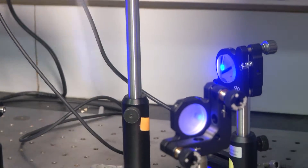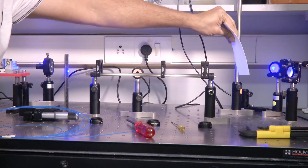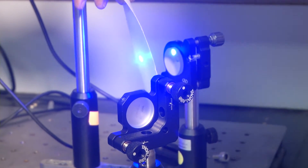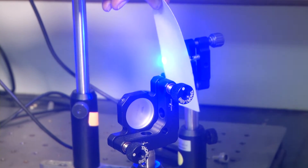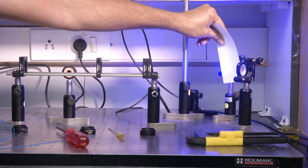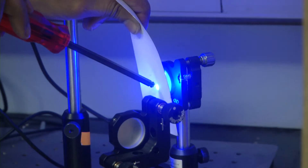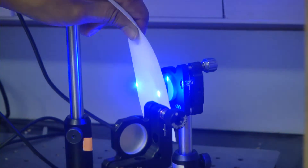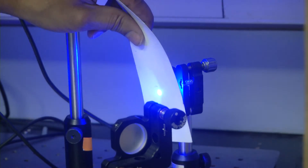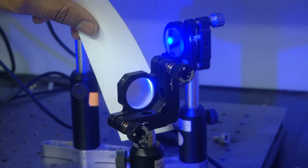Normally we would do it from the other side, but the principle is exactly the same. As you are removing the block — the main incoming beam — you trace the light and orient the mirror. You want to go as close as possible and start to release the beam so that your card is wide enough to capture the reflection. You want to go closer because that is safer: you know where the mirror is reflecting the beam, and as long as you and your colleagues are not in the beam path, you can place the mirror.